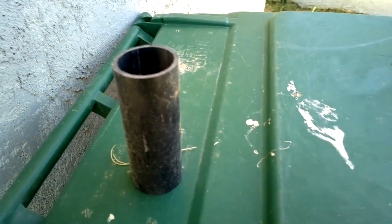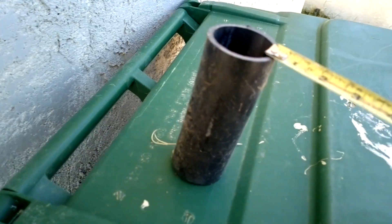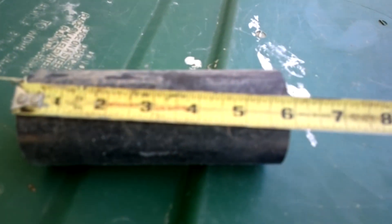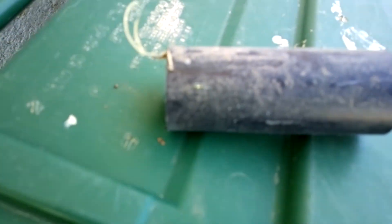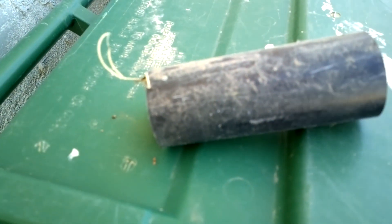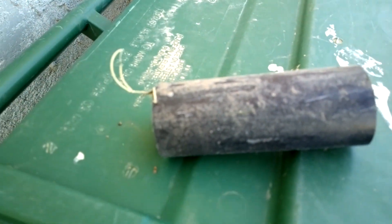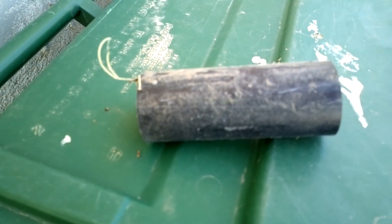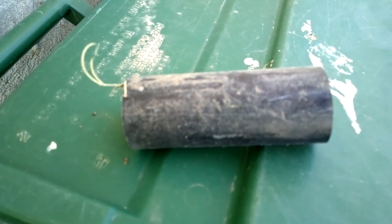Wait — it's typically going to measure that cut-off hole. Let's look at this. This here is about — wow, look at that — almost six inches, almost. I'll need something that's going to be bigger than six inches for my clean-out. And knowing this here is a two-inch ABS pipe, I'll need to get some parts. We're ready to go to the store now.